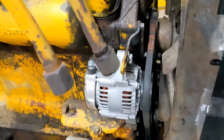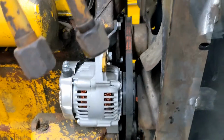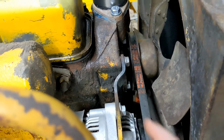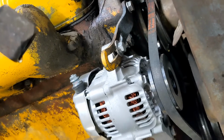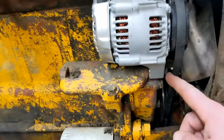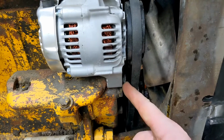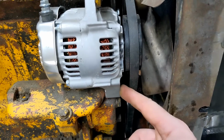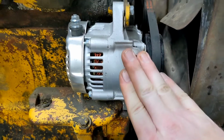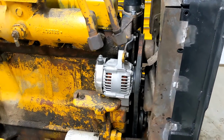However, previously, a viewer reached out to me and was trying to see how to mount the alternator. I had to reverse this little alternator arm, and then it swung the other way than it originally did. It used to swing around the generator. And then I had to get a shoulder bolt from Fastenal. I think this was a 5/16 thread, and then I needed a 3/8 shoulder to accommodate this. I think it was a Kubota's alternator or something like that. I got it offline. It's gonna be awesome. It's gonna be single wire and eliminate all of the voltage regulator and whatnot.